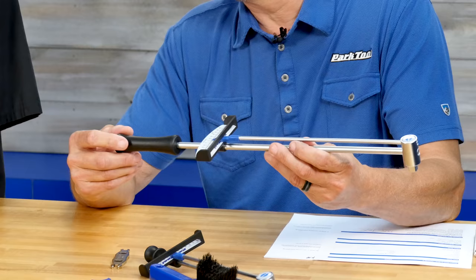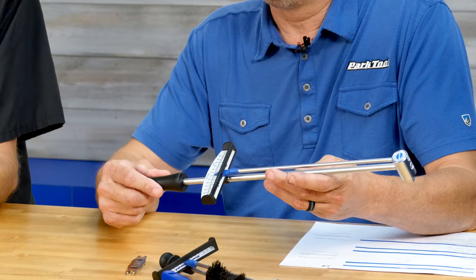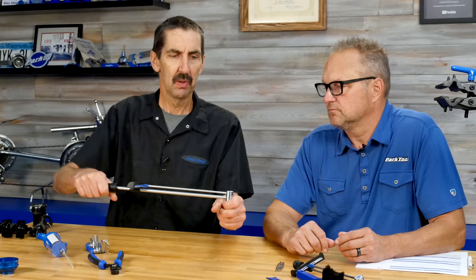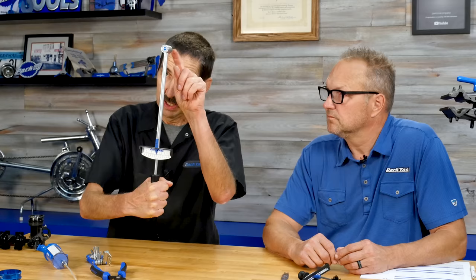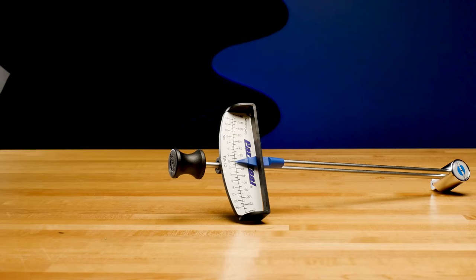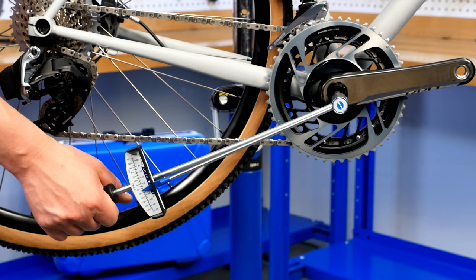We've got two new torque wrenches. We make click-style torque wrenches where you dial up your torque spec, but these are beam style. They've been around a long time and we used to make these — now we're making our own. The click style winds up a spring and clicks over, whereas this one is based on the science of steel flexing. As you pull tighter, the beam flexes and you measure the effort on the scale. You watch the needle, you know the torque, you're done. Not a torque limiter — just a torque measure. We have two models: the TW 1.2 and TW 2.2, with a small range and a much bigger range.